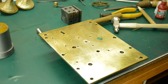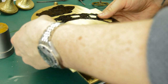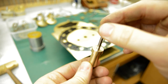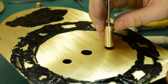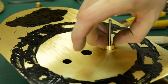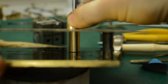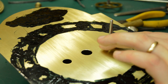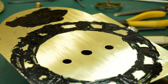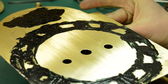So I plug the hole up completely and then I've made up this tool — I make the brass part to suit each individual clock — so that it will go in through the winding hole. It's a nice snug fit and sits down against the dial, but it also sits down flat against the plate so I'm getting it parallel. I'm certain that I've got the centre captured now, and a little centre-pop should have left a divot in the plug that we've made, giving me an accurate positioning for that winding hole.